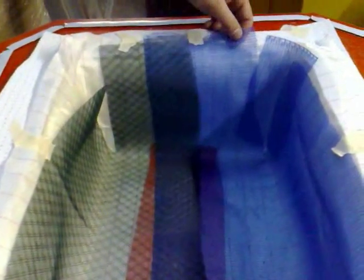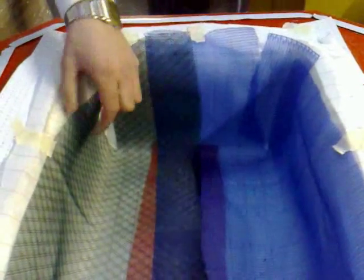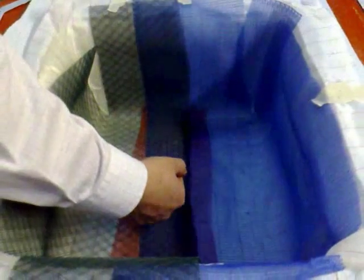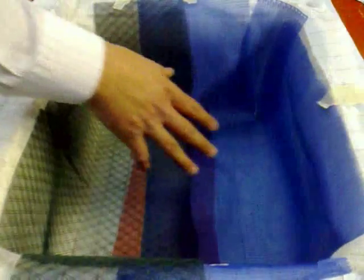So we've got two different meshes in there - this is the diamond one, and the blue is the knitted mesh. You've got VI1 and VI2. What's the difference between those two? It's for different resin viscosities primarily. The blue mesh tends to be better for lower viscosity resins, whereas the VI2 diamond mesh tends to be better for higher viscosity resins. It just allows the vacuum bag to stand off the surface a bit more - as you can see you've got a much bigger open area there. We'll probably see later on when we apply the resin that it races along the diamond mesh a lot faster than it would the blue mesh, though that might not necessarily happen that way.